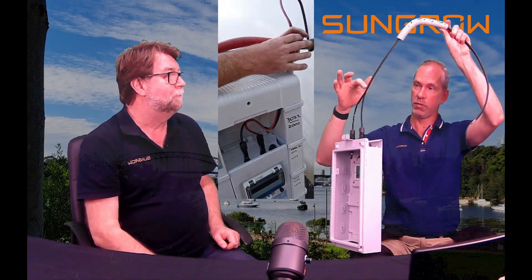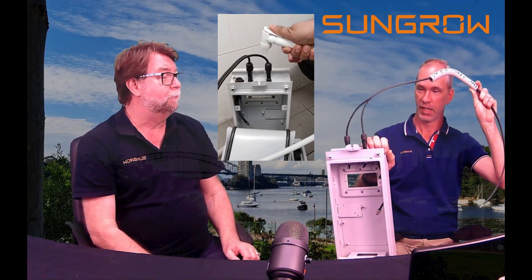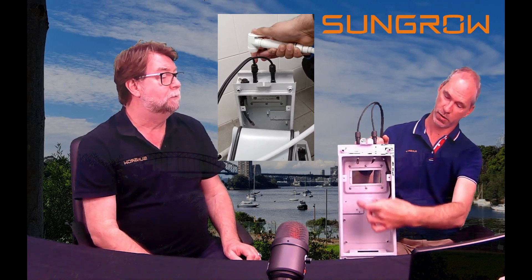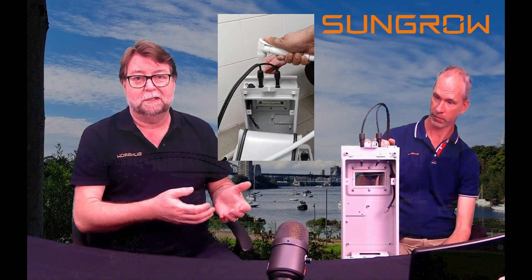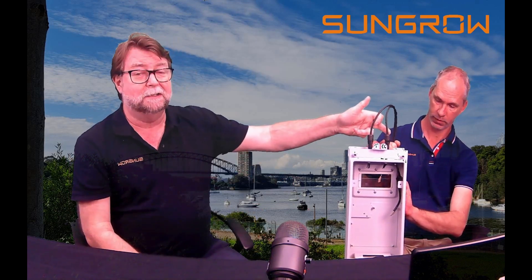What I did find was in your switchgear — I've just gutted this so I can see what's happening inside — water is tracking down the cable in through the back of the MC4, if they're not correctly done, as demonstrated. Basically, it's coming down through the back of the plug and going for a swim inside. This is a case where you haven't tightened them up as tight as they should be. As per the manufacturer's instructions, to retain the IP rating — the IP55 — these have to be tightened properly.